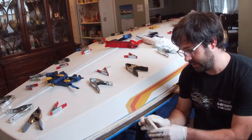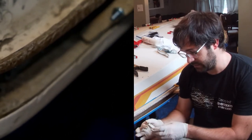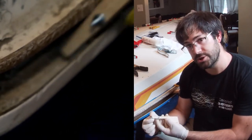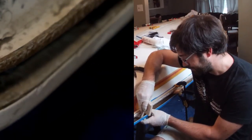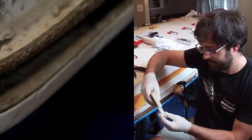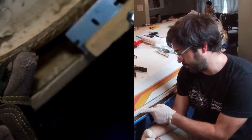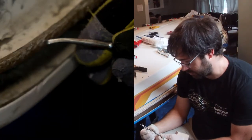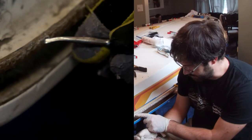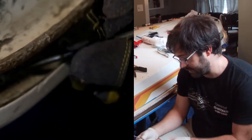I took a piece of wood and cut a thin little finger with a slot in it. I can use that to pinch either a washer — which works really well to get down into the interior radius — or just a straight razor blade, which worked really well for the upper part. I also used a couple of dental picks, which are really handy when there's caulk in a small recess or divot — you can get in there and scrape it out.